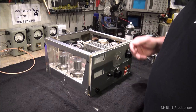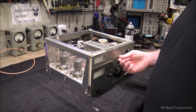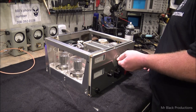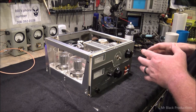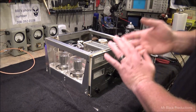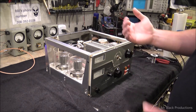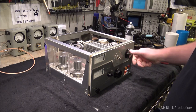So I was sitting here lubing up stuff, spinning the plate adjustment knob, and it has a tendency to kind of slip unless you put a little bit of upward torque on it. Well, we can't have that. There's no outside torque adjustment, so to get in there I have to take this portion off — there's a passive clutch, a reduction gear, and a passive clutch to make this work — so that the dial indicator on the front moves in correspondence with the knob and the capacitor actually moves. I've got to take the face off this thing. I'm not excited about this.